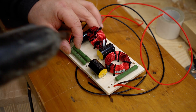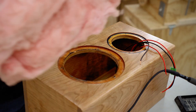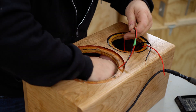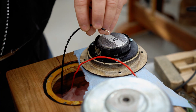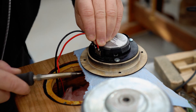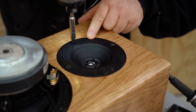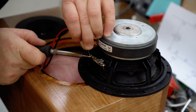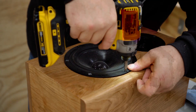The fact is, if you're going to get into building your own speakers and want to do them properly, this is the way to go. You need a little bit of equipment, and you also need some parts to put together test crossovers. After you have that nailed, you can order new parts and build the finished crossovers — that's exactly what I did here, and that's part of the reason why this project dragged on as long as it did. After I had them all reassembled and buttoned up, I tested them again, measured a frequency response, and compared that to the simulation — and it was bang on.